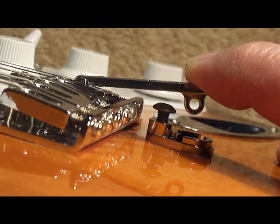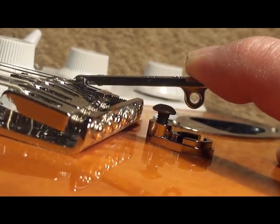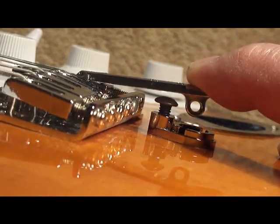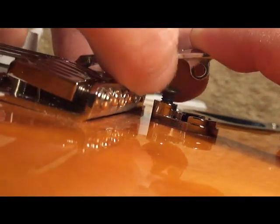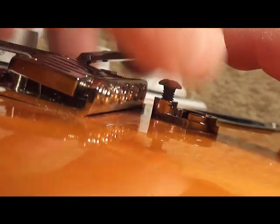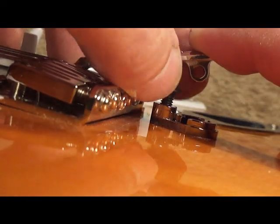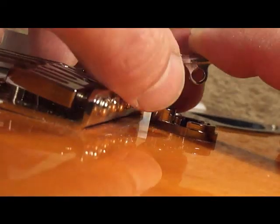Align the stop washer and tighten with a coin. The stop screw on the puller attachment is not meant to be a fine tuner for the bender travel. That is accomplished through the bender lever's stop screw. This screw is strictly to prevent damage to the bender lever at a full pull. Adjust the stop screw up until it almost makes contact with the bender lever.